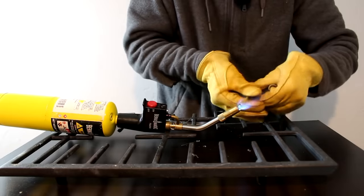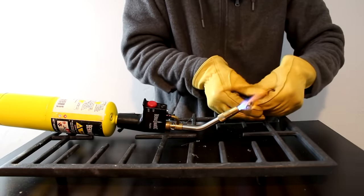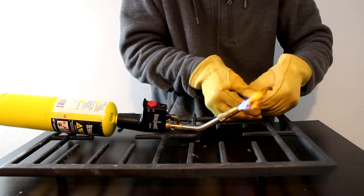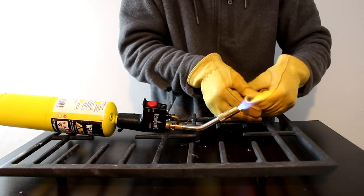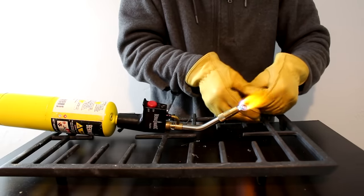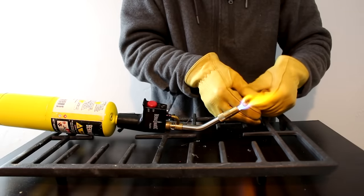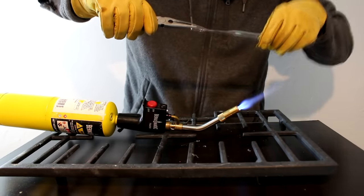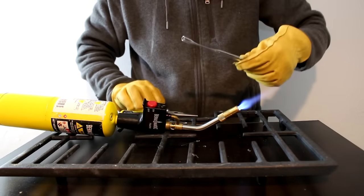Now I'm going to grab this other end of it and do pretty much the same thing, but I'm not going to snip it off this time. You see, the problem I've been having is the combustion products of this torch actually produces water vapor. And when I've got the tube cooled down to cryogenic temperatures, any water vapor that gets in instantly solidifies and gets trapped. So I must do it in such a way that the gases have no contact to the outside air while I'm sealing it. Okay, just give this a stretch, just like that, try to keep it straight. And there's my ampule done.